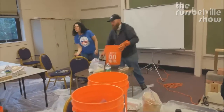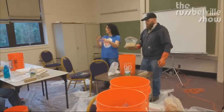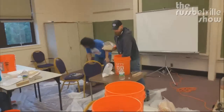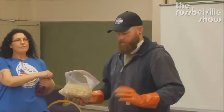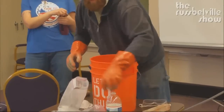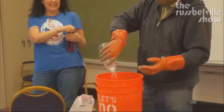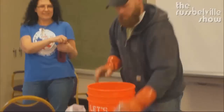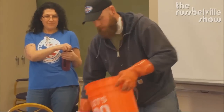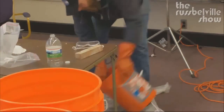Notice he's digging in the bottom — like as if you were making brownie batter, you would dig right to the corners of that bowl. You would make sure that your flour was mixed in. The lime is going to want to travel to the bottom in some cases and kind of cake from the bottom. Just like you're making pancakes or whatever. I'm going to go ahead and introduce the rest of the hurd and the rest of the water. There's more material so it's going to be a little bit harder to churn, so you'll really want to get in there and work it out. For the sake of time, I brought my mixing tool with me.